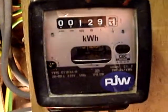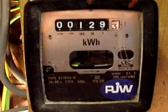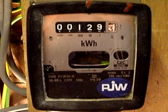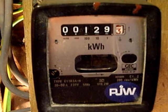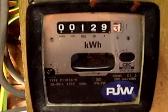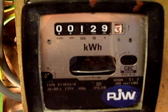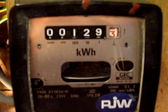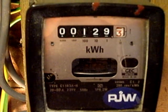Now if we have a look at the meter here — this is an analog meter which I've put in — you can just see the mark coming past. You can see the jerky movement as it comes past. So every jerk is the triac coming on, putting 60 joules of energy into the hot water cylinder. So the hot water cylinder is taking the power; we're clearly not at maximum thermostat — maybe we've run off a little bit of water since it ran earlier.